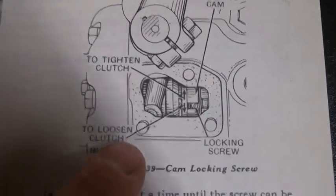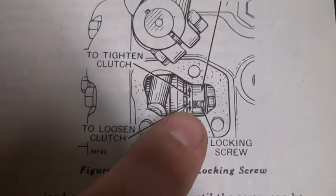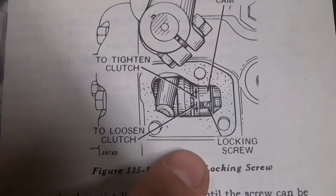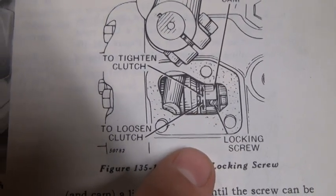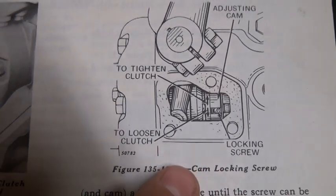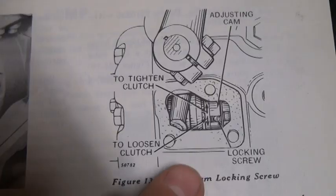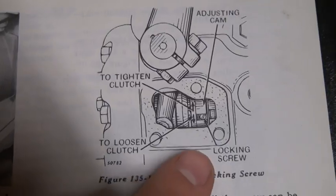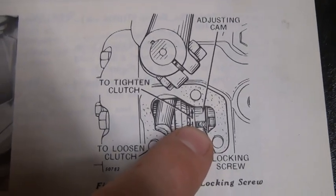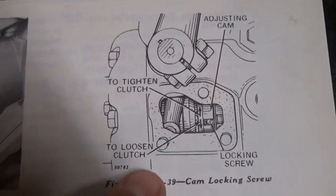When we get in there, we went over the procedure to find the locking screw. To adjust, once we find the locking screw, if we need to make an adjustment — this also applies if your tractor didn't need an overhaul on the clutch but it started slipping and you wanted to adjust it before investing in costly parts — it might be worthwhile to check the adjustment. To follow this procedure, we would actually turn the locking screw in.